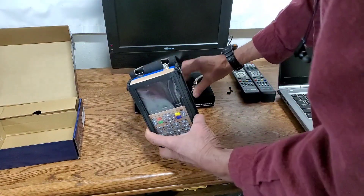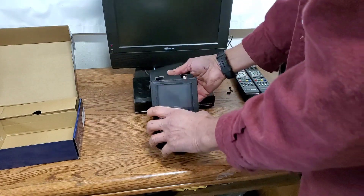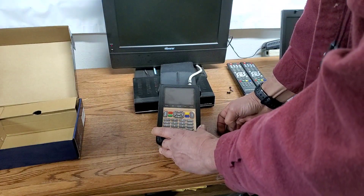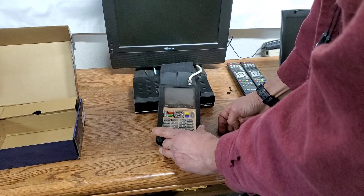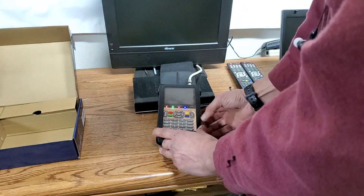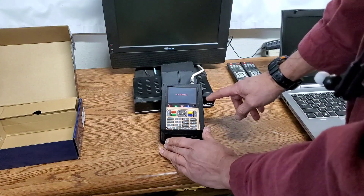There's a little switch on top here. As you can see, just power it on. Always power on with the coax cable plugged in so there's no surge on the LNB or the meter. Go ahead and power it on — you can see the lights are on now.